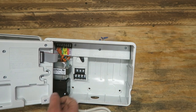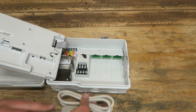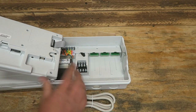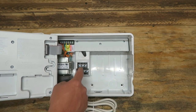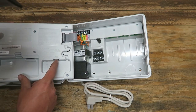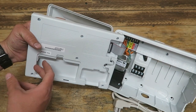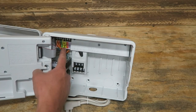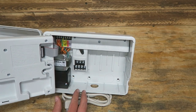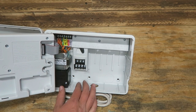Your sensor plugs in up here, your power goes in here. I'm glad to see this comes with a pigtail — sometimes you have to order them with pigtails separately. If it doesn't have a pigtail, you can hardwire it and have an electrician plumb into this box. Here's where your Wi-Fi module goes — right in here. You can put a nine-volt battery right here and it holds your memory. We've got a flow sensor terminal here, and you can put a rain sensor on here as well. If you're putting in a flow sensor, you ought to put in a master valve too. Here you've got the MV — master valve — terminal on top.